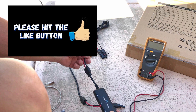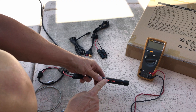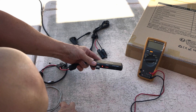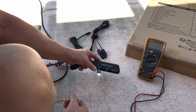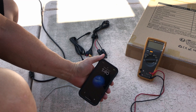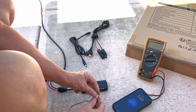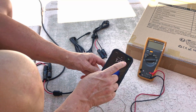Now let's connect the USB power hub to the solar panel directly using the supplied MC4 connectors. A red light illuminates on the USB power hub confirming connection. Testing with a USB-C adapter — plugging a phone cable in and then the phone itself — it made a noise and it's showing it's charging, so that definitely works. Removing the adapter and trying USB-A also results in confirmed charging.